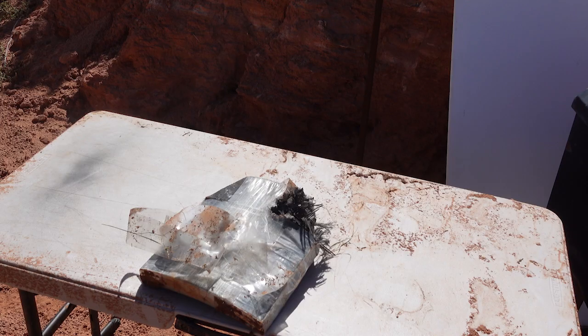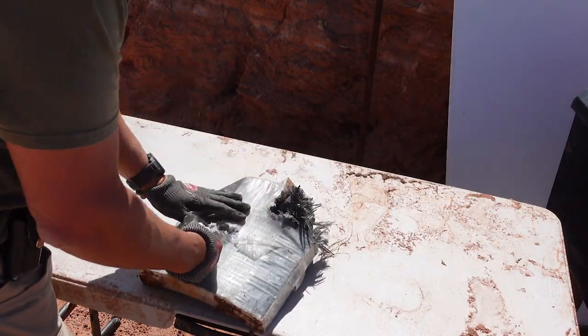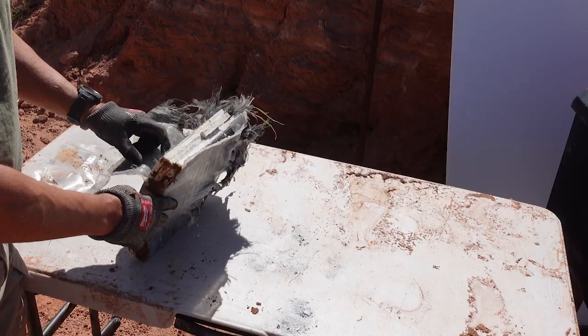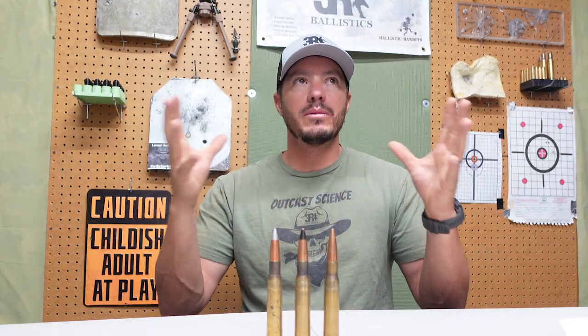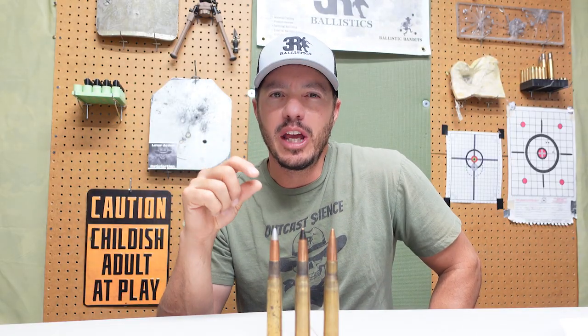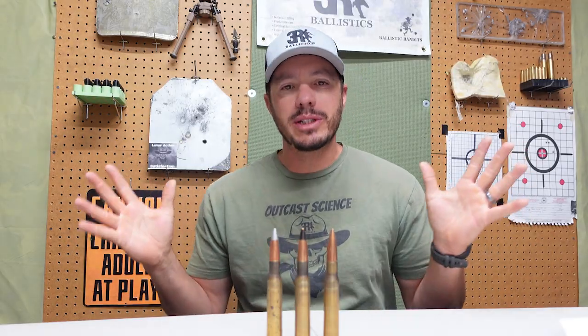Both cores of those are right in there. So what do we mean by recycled material? These are R&D plates. We've been doing some material science R&D, and what we did is take a level four plate and add another layer of alumina ceramic. Today's recycled body armor plate was just a baseline R&D plate — we had some leftover components and added that extra ceramic tile. It measured 12 by 10 inches, was one and a half inches thick total, and weighed 10.3 pounds. Our real goal moving forward is to find the lightest, thinnest, and most practical material or combination of materials that can actually stop AP 50 BMG without an insane price tag.